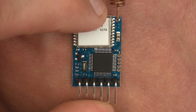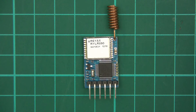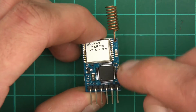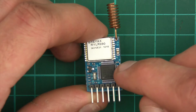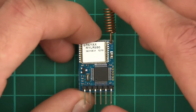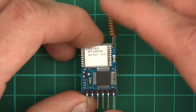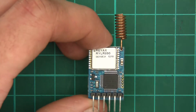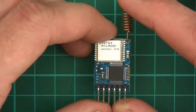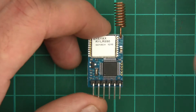You can see that it says STM32L, and that's a microcontroller. So when I noticed that I was thinking — why would there be a microcontroller on this module? Basically, the transceiver chip is managed by the microcontroller on here. So when you connect this to an Arduino, you don't actually connect to the transceiver — you connect to the chip which controls the transceiver. And that makes the whole thing a lot simpler. Instead of interacting directly with it, you interact with the chip which deals with everything for you. It's really simple.